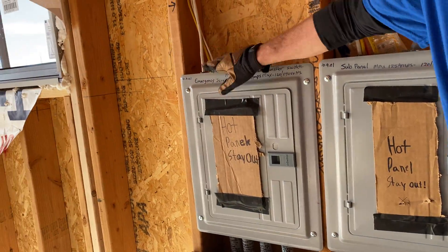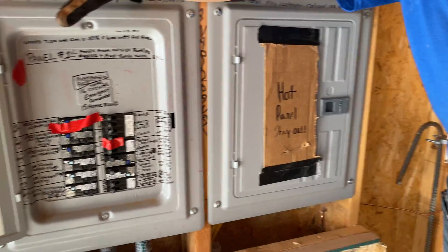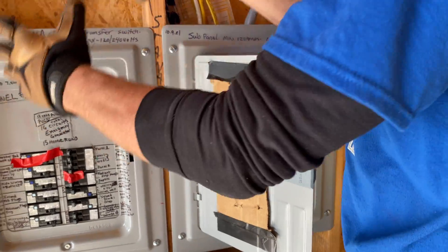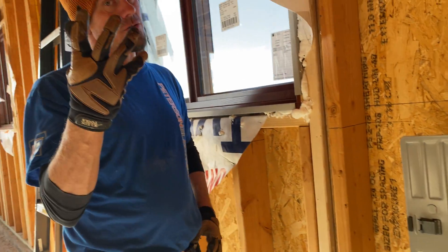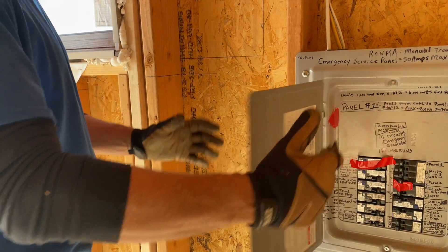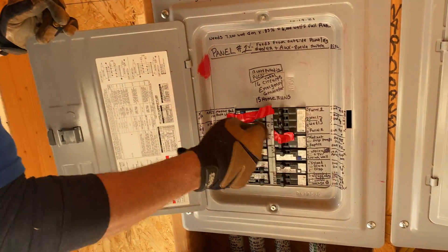This is my peek hole for it if they decide to drywall. That transfer switch only goes to this panel. We have four one-inch conduits I labeled that we did under slab — this whole entire house is all on slab. The other panel is a sub-panel for 125 amps that is non-emergency. So if you have a house where you need to identify certain circuits, you have to trace the house. If it goes in overhead, you have to have four wires feeding that panel. If it's three, you've got to replace that sub feeder. Then you nipple to it next to it and put in the circuits that are only for that panel to be served by the transfer switch. But this idea of people using red and green and yellow stickers — hey honey, you remember this on the phone when I'm out of town — that's not how you do it. That's how you end up dead or burn your home down or wreck your utility transformer, or all of the above.